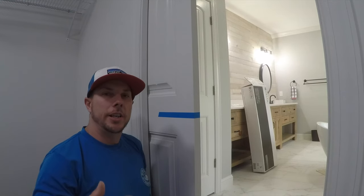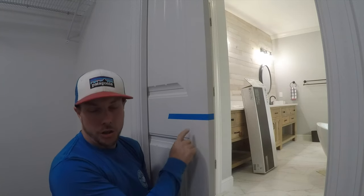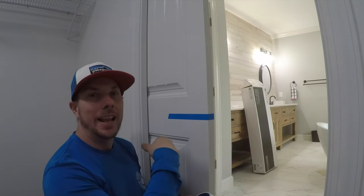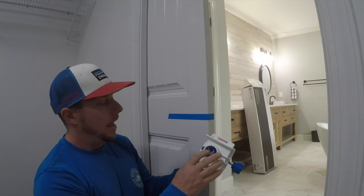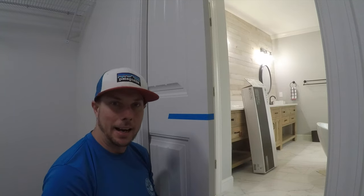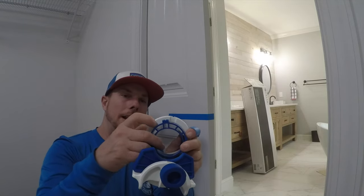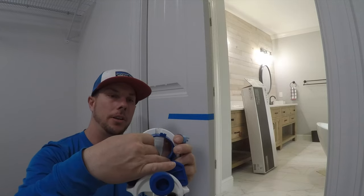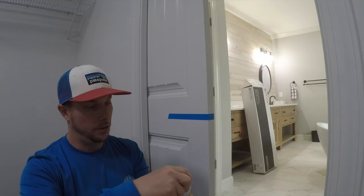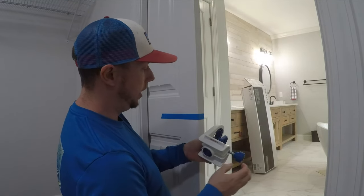The first thing you want to determine when setting your jig up is your door thickness and how far back you want your doorknob to set. This jig will set at 1-3/8 inch door thickness and 1-3/4 inch door thickness. It will also set at 2-3/8 back or 2-3/4 back, which is for exterior doors in most cases. This piece right here pops out, flips around, sets back in, and then you can read the readout for the thickness of your door. Now I'm ready to install the actual jig on the door.